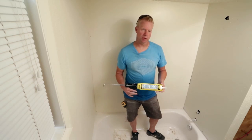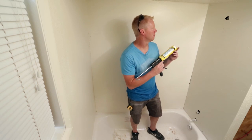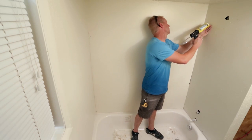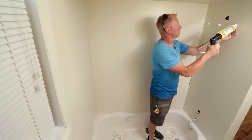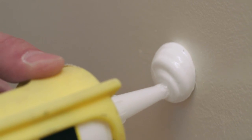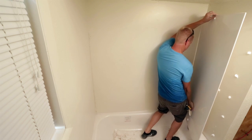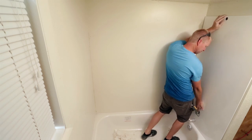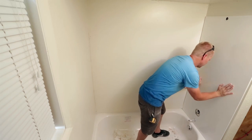This step we're going to put the glue on the wall. We recommend 100% silicone, and I like to space my blobs every 8 inches apart. I like to just push it in so that the glue sets behind the small holes, and then we're going to put the marble up.